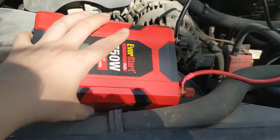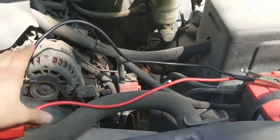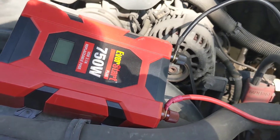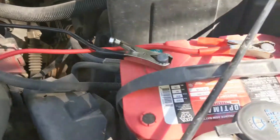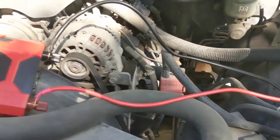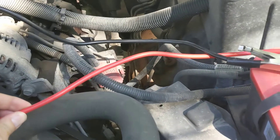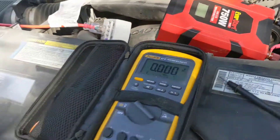I don't say that because of what's inside. I say that for two reasons. Number one, these cables — we're talking about 750 watts out of an inverter. Let's say it's 80% efficient; that means from the battery you've got to pull 900-something watts at 12.6 nominal volts. I did the math — that means we're talking about 75 amps through these. I don't even know what gauge this is, 10 gauge? It's not going to happen.